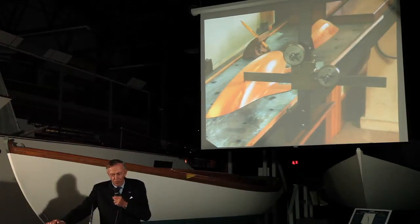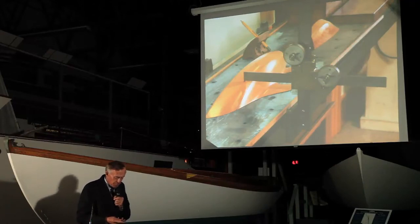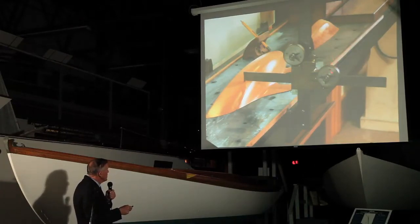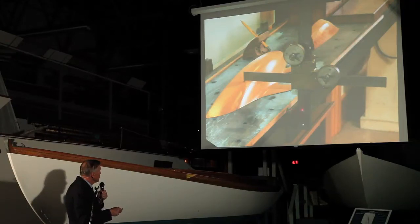He had the famous instrument makers Brown & Sharp construct the offset machine for him. It's comprised of a steel table with a very accurate track running along it. A batten marks every frame location in the finished boat, and there's a pointer on the moving apparatus where you can align precisely with each frame position. A bronze piece moves up and down, and a very rigid steel arm moves in and out, so you proceed around the hull intersecting the surface at each point.